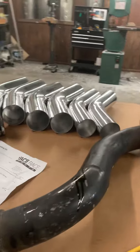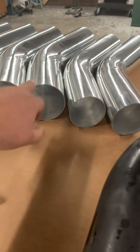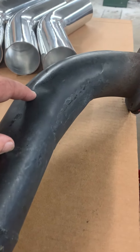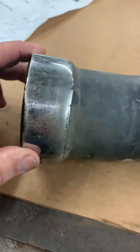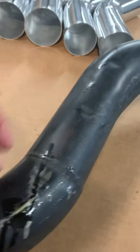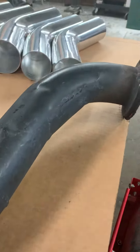So what we're going to be doing — here's your outer pipe, this is three and a half inch diameter. This is your inner pipe, this is three inch. Your inner pipe will only be used up here where we're making a water jacket. Then the three and a half inch pipe will come down and match the size of this little collar that they put on originally. So we'll have a water jacket section, we'll insert the water here, and this part will be wet and jacketed — wet inside the jacket.